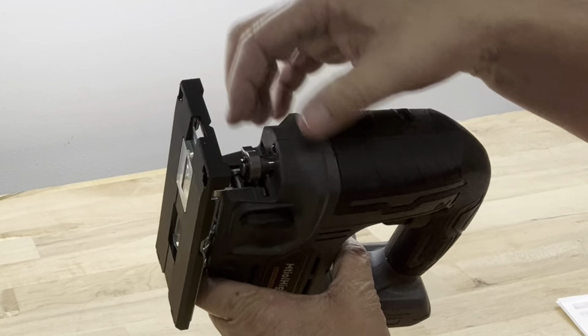This is your metal base plate to keep your jigsaw straight while cutting. The base plate can be adjusted from zero to 15, 30, to 45 degree angles, either left or right. You just loosen the two Phillips head screws and adjust it. The degrees are printed on the base — 45, 30, 15, and zero — so you just make your selection, tighten up the screws, and you're ready to go.